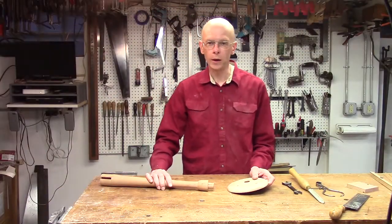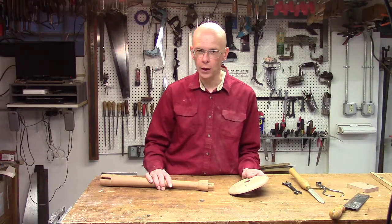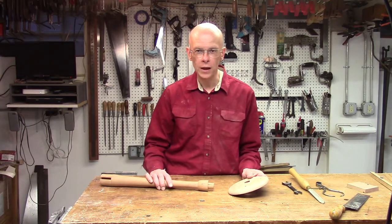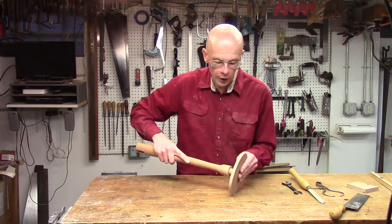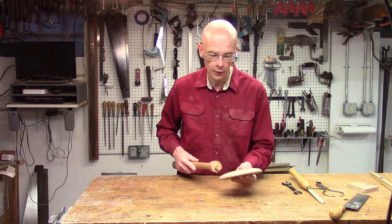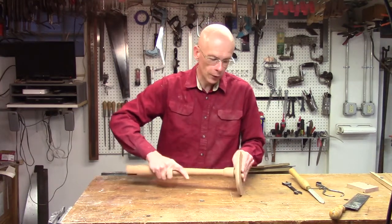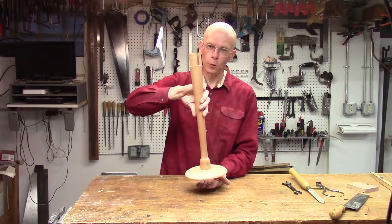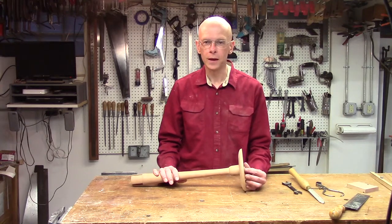That looks really good all the way along its length. The proof, as they say, is in the pudding, so I want to check the fit of the tenon in the drilled hole. I'm looking for a tenon that goes together with some resistance — I certainly don't want to have to beat on it, but I also want it to hold together under its own weight. Since this one is wedged, the tolerances are greater, but I still want a good fit. I want to make sure that when fully driven home, the slot for the wedge is across the grain, not with the grain, so I don't potentially split the subtop. And it drops together and stays together under its own weight, so I'm quite satisfied with that. Thank you for watching this short video, and I hope you'll incorporate this technique into your shop.